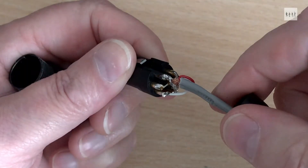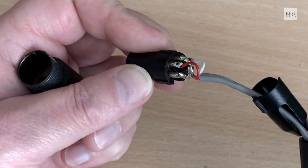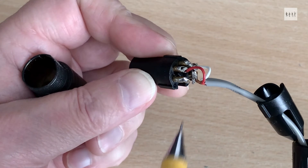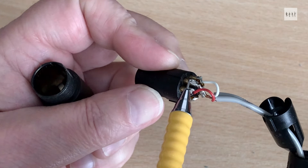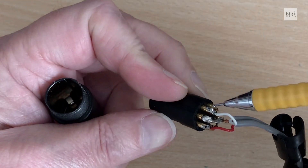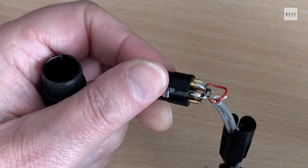The original unbalanced cable was rather too short for my liking, so this is one I made up with a longer lead. You can see how the pins are wired here, with pins one, three and five all commoned and grounded. Please excuse my rather crude soldering.